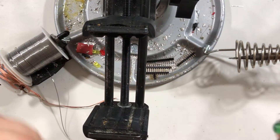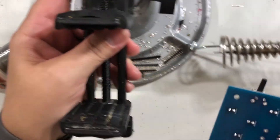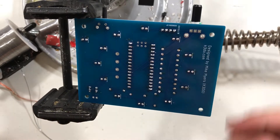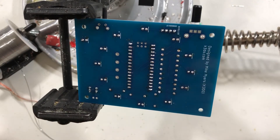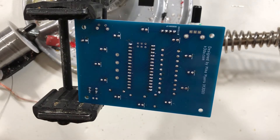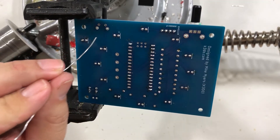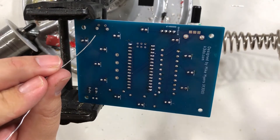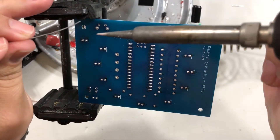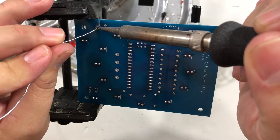We're going to bring back our soldering stuff. In this particular one I can't get the whole thing in the camera anymore because I've got the button there. With the button and potentiometer, both have two pins that don't do anything electrically — they're grounded, but they're basically there for stability when you push on it. Those take a lot more solder, so we're going to do those first. Put your soldering iron down — it's going to take a lot more solder.